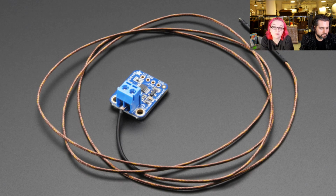They make lovely chips. I don't remember the voltages. I think it handles negative 250 to 750 degrees Celsius, I think, is the limit for this sensor. And what's actually really nice, it can run off of a wide range of voltages. You can run up to like 18 volts, which is maybe useful in some industrial automation situations.